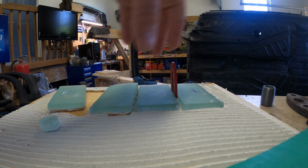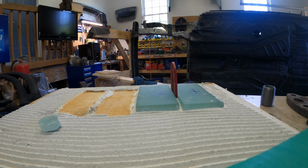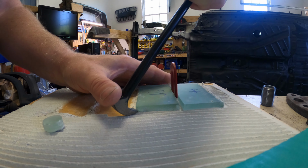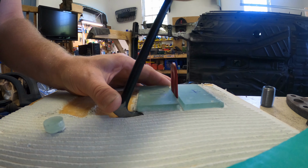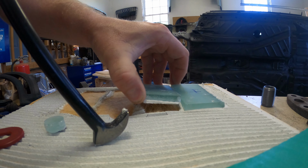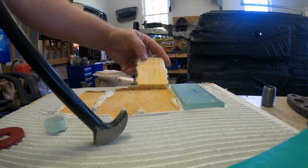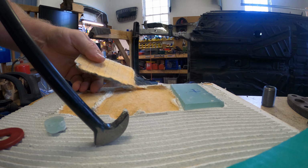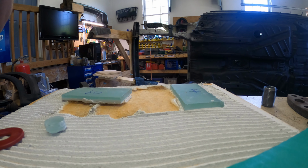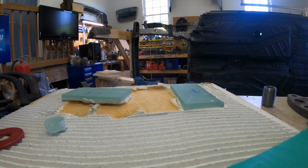Okay, day three. I don't think it's going to be any different. One thing I'll do though, when I do it with the Ardex, is instead of leaving it down here in the garage where it's hotter all day long, I'll go ahead and leave it upstairs and we'll do the tests up there. Yeah, it's the same thing. This one actually started to peel some of its neighborhood, it looked like. So we'll leave it in the bathroom, so it has the same conditions as where we're tiling. That way we're confident that everything's setting up correctly and won't fall on us.